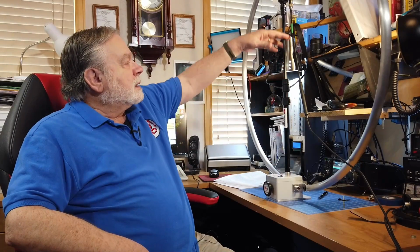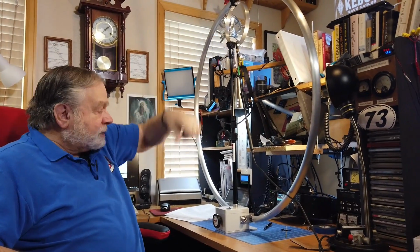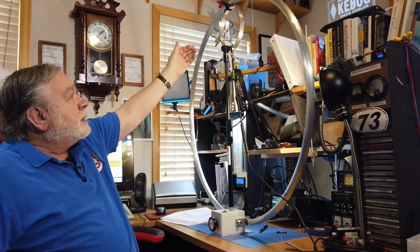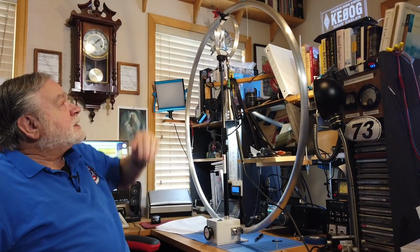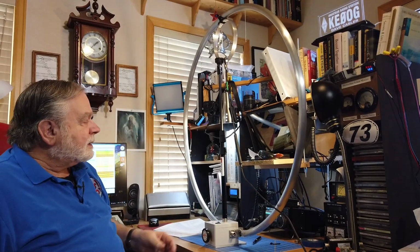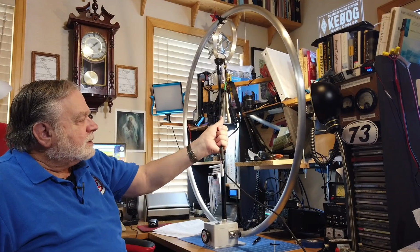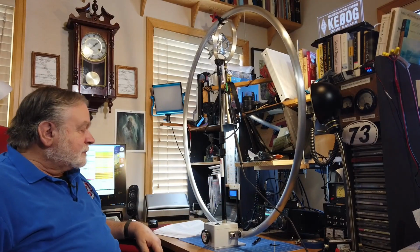In a previous video, I showed you the basic. The basic uses the same capacitor tuning, a little thing to hold the loop up. This is the loop that couples to the big loop. On this particular one, they suggested that I keep this about a 1/4 inch away from this. So I stuck a piece of cardboard in there so they would stay apart. I don't want them flopping around or anything. The cable here has ferrite beads in it as a common mode choke to keep the common modes from going down to the radio. Okay?